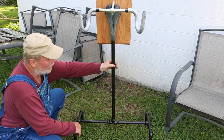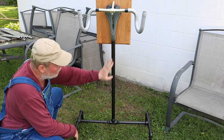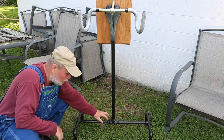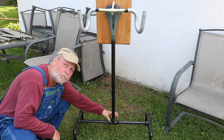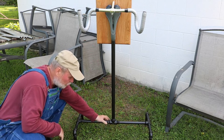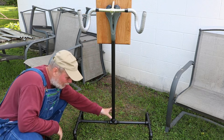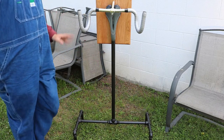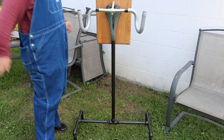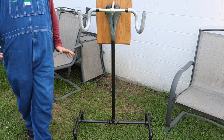Now in the middle, I wanted this to go up because I wanted the stem of the handlebars to literally slide down inside the pipe and mount, so that when affixed it would provide a stand. So I needed one-inch pipe here or at least a one-inch adapter. But I thought the look would be better if it was solid all the way down. I originally looked for a tee with two three-quarter outlets and a one-inch outlet going up and couldn't find them, so I ended up getting reducers going from three-quarter up to one inch and put a one-inch pipe going up.